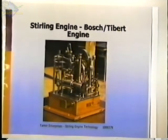that space can be a thermal loss if it's too large, or it can be a thermal loss if it's too small, and it's something that is adjusted, and it's probably different in almost every engine. It's related to the speed, the length of the space, and probably both. I know someone, an engine builder there in California, and he's done it by cut and try.